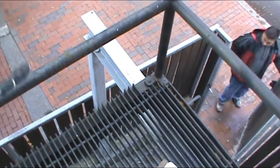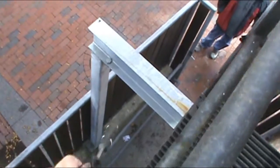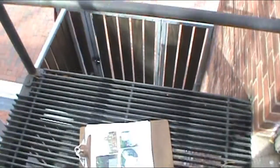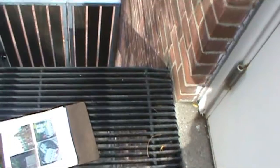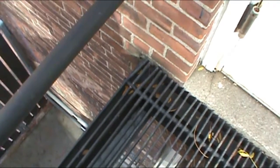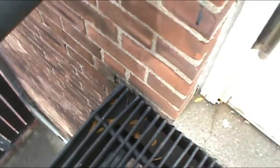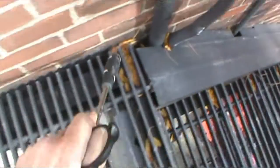This is a mesh of some old construction with new. Someone's moved the legs out, so they've put some new legs down on this small knee wall, coming up with an I-beam bridge coming across. The bridge itself is not tied into the masonry, it's tied into the original construction, so we're still going to be relying on the original structural connection, which is embedded here. So I have one channel embedded here. I do have a through bolt here, and I do have another embedded channel here.